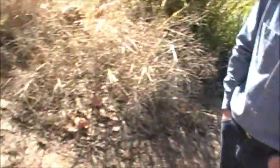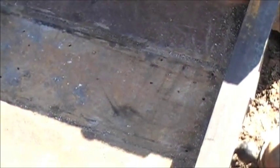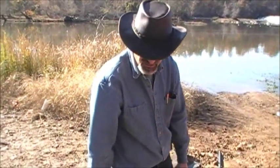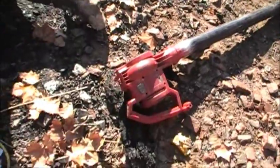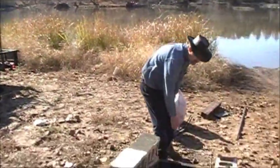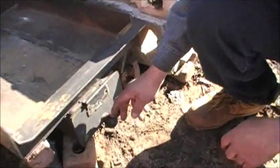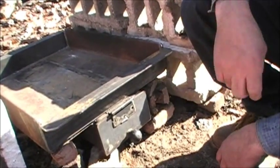This is the forge that I made from some scrap metal a few days ago. It's made from a piece of tube steel - 4x8 by 3/8 of an inch gauge, very heavy. I burned holes into it and I tested the forge yesterday and it was working okay. Some holes are plugged with dirt but it's working. I have the leaf blower on that side and the generator here. I also have an improvised door that adjusts the airflow - by closing or opening it, you get more or less air into the whole thing.